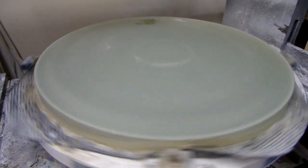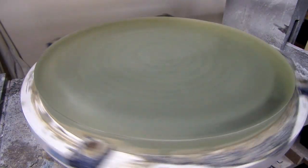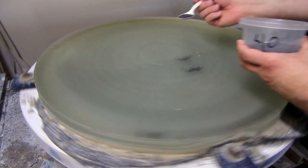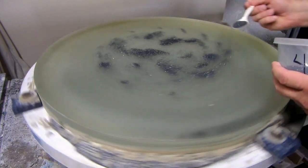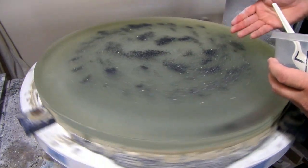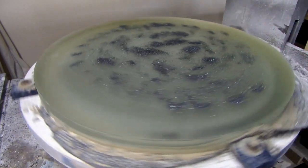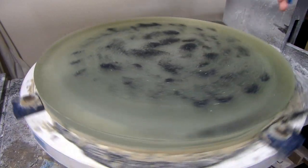First step: I've got the tool soaking over there so it's moist, and my first step is just to wet this down. Then I throw some number 40 silicon carbide abrasive on there — normal stuff you'd use for any mirror grinding. Number 40 is pretty coarse. Most people who do mirror grinding don't get exposed to much coarser than about number 80, but I use 24, 40, and 60 as well because I quite often do heavy-duty projects where I need quite a bit of glass removal. I like to apply the abrasive with the turntable running — it just helps distribute it around a little bit, makes it easier.